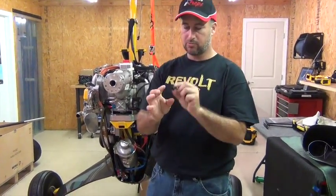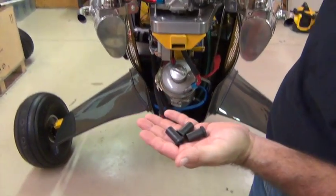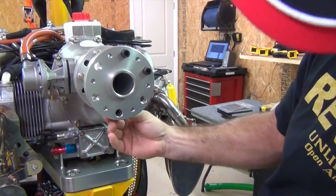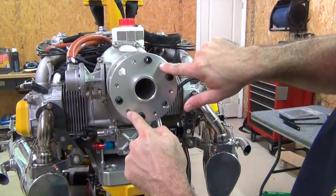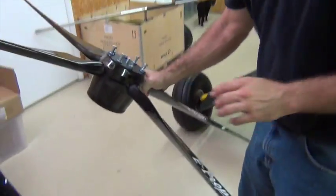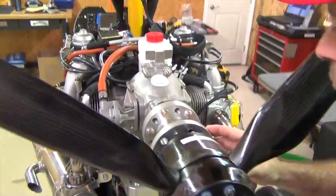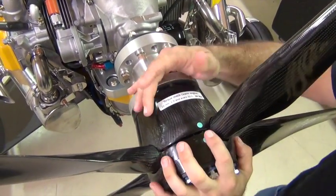What E-Props provides are threaded drive lugs — there are just four of them for the four-blade; the six-blade has six — and we're going to insert them into the propeller. You can pick any four that you want so long as the two are opposed to each other and next to each other. These extra holes are actually for adding weight, so just ignore them. Then I can pick up the propeller as an assembled unit and we're going to use these four that go all the way through to line up with the drive lugs. We're just going to slide the prop on and push it into position.